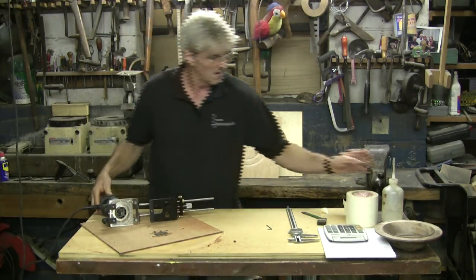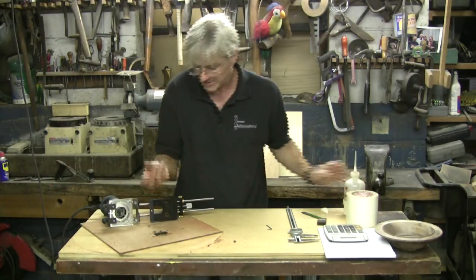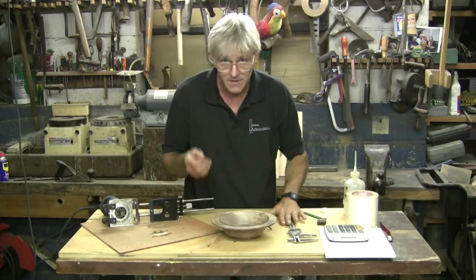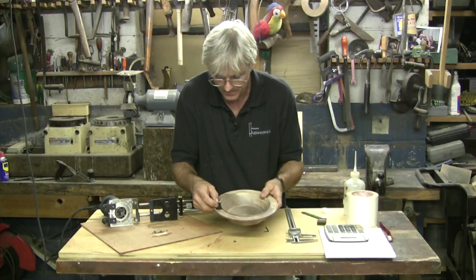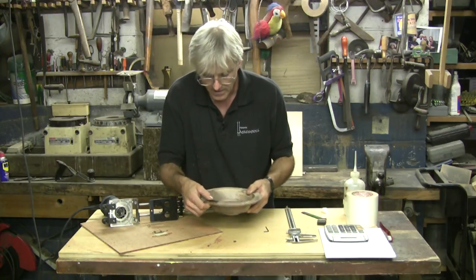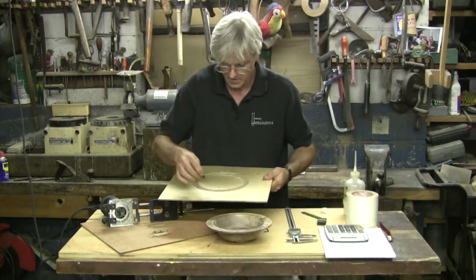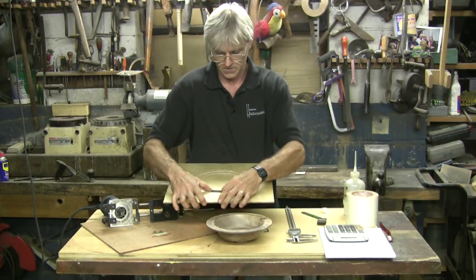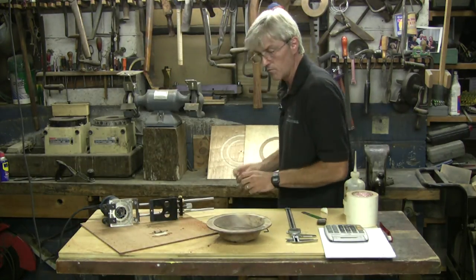Okay, a little bit of acetone dripped on that inlay wafer will flash through the end grain immediately and release the tape. And now the moment of truth, does it fit perfectly? And it does, as is typical. That micrometer adjustment is a wonderful thing. There's no movement. I'm going to check its fit with my softwood groove. Remember, we want it to be snug but slidable. And it's just what we would have. Excellent. Okay, so we have our stop collars set right where they need to be.